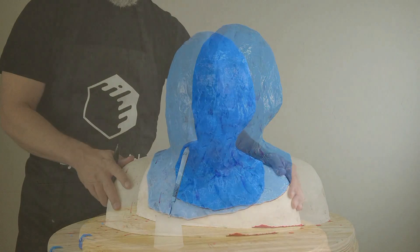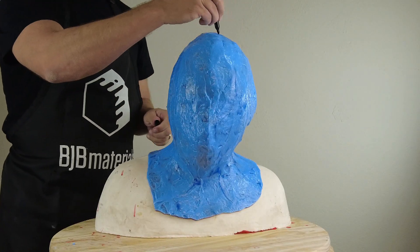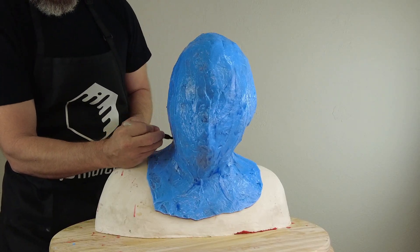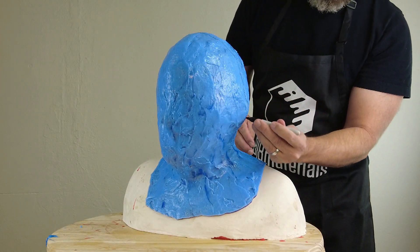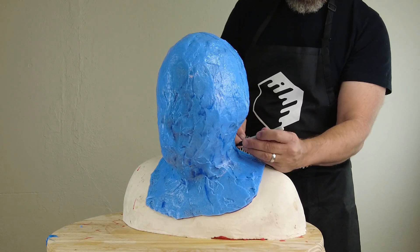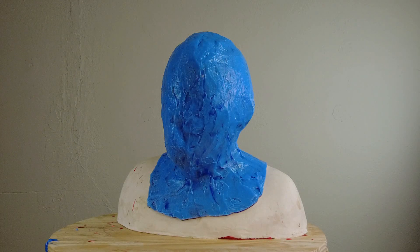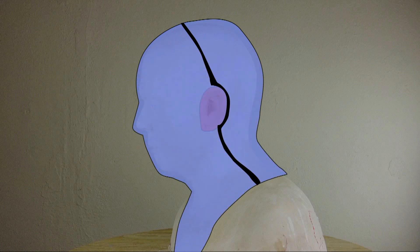One of the things we want to do is plan out the way our shell is going to part. We could do it in two halves — left and right, or front and back. In this case I'm going front to back, putting the seam right down the back of the head. I'm using a Sharpie marker to draw that seam line. It won't be permanent on the silicone, but it'll stay put long enough to establish that parting line. Just to recap: this mold used two different silicones — the softer 5110F on the ears and the 5130F everywhere else.